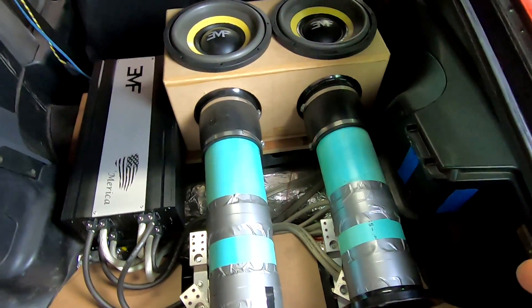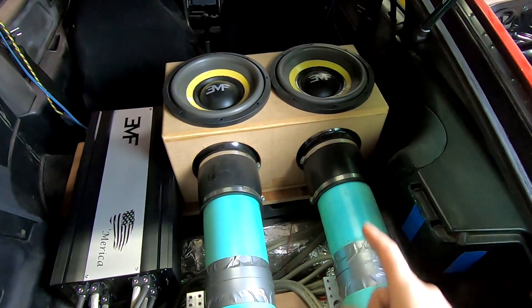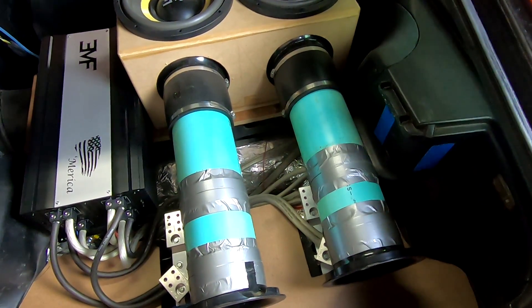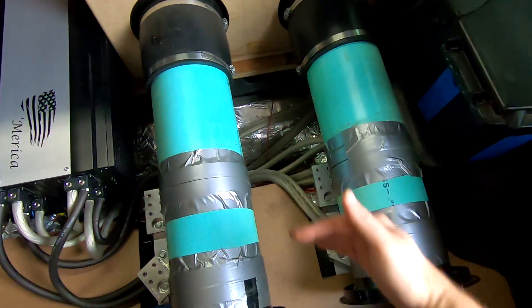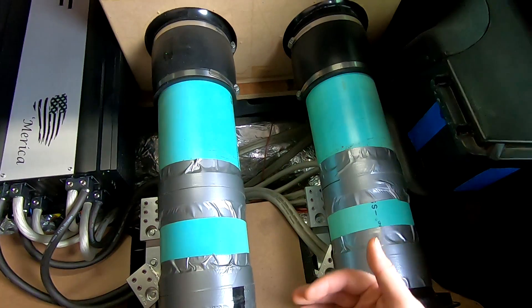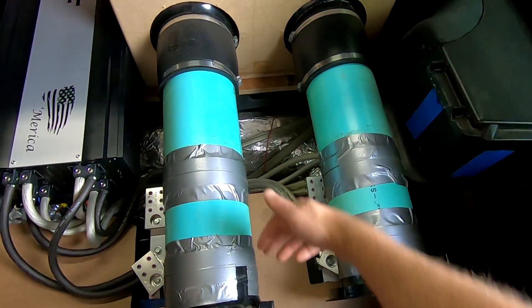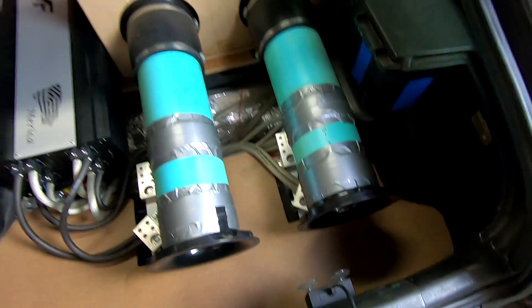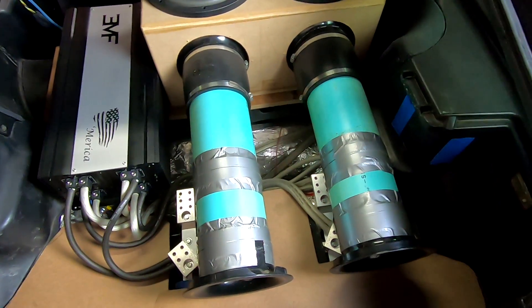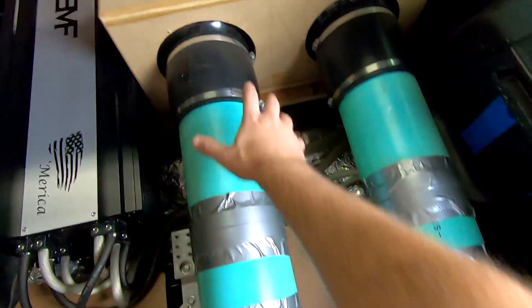What is happening here is we have the enclosure — it's a very small space — and contrary to what many believe, ports don't just push air. It's actually resonating air. There's air coming in and out. If you watch it in slow motion, you'll actually see something at the port moving this way, not just straight out. Initially you might have a surge that leads to some turbulence, but on the whole it's just going to suck air in and out. All of that is resonating here.